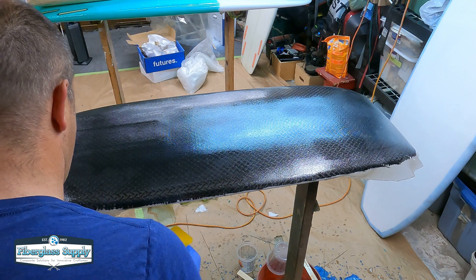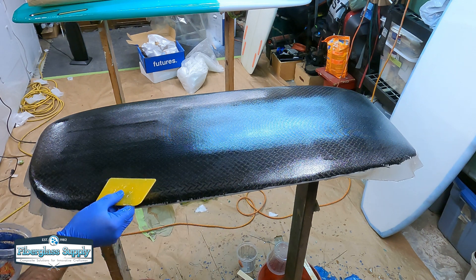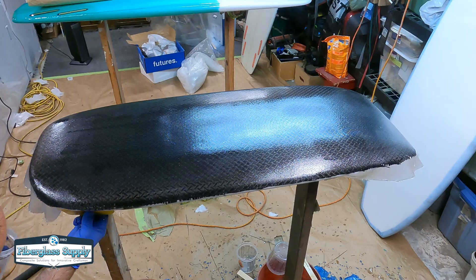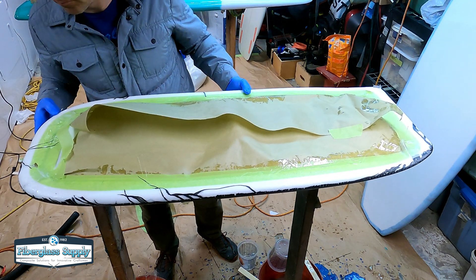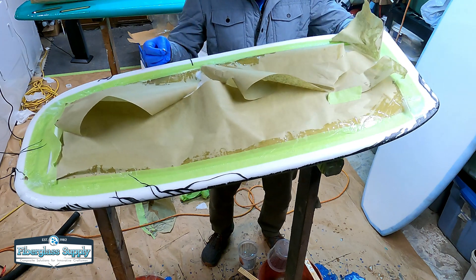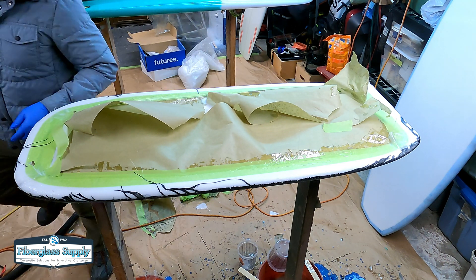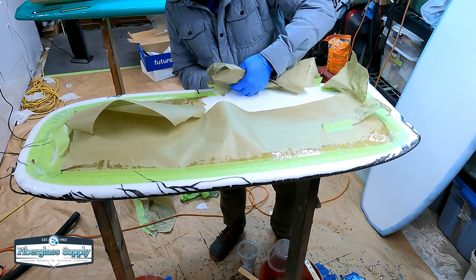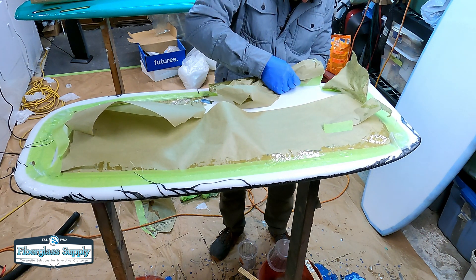Once we have that all wet out we are going to lap up the laps. I come around with the squeegee and push the glass and carbon that is hanging down up around the bottom and onto the tape. You want to go around your rails and double check for drips. With epoxy I will wait ten minutes, come back and check it, and wait another ten. The nice thing about epoxy is it cures in a linear fashion — it will get gooey, then like honey, then hard. Once the epoxy is cured — I like to catch it at about cheddar cheese state, not fully cured but hard enough to handle and still soft enough to flex — I will come back and trim that lap line.